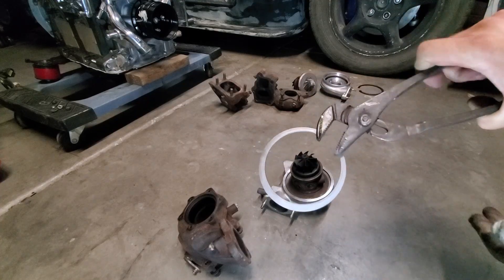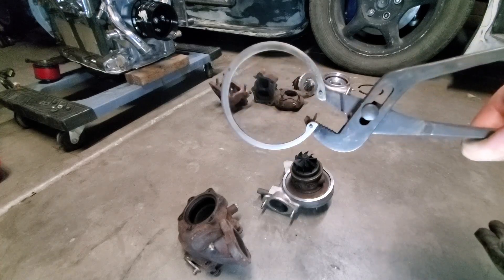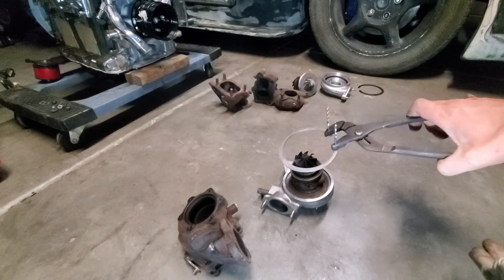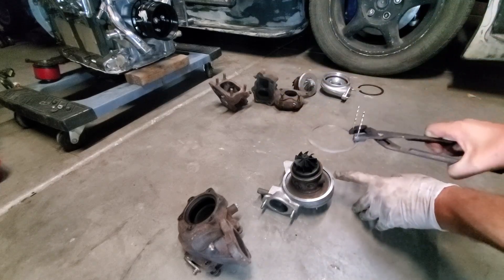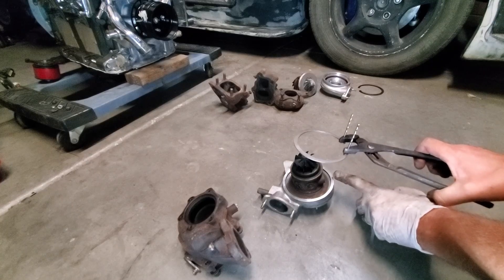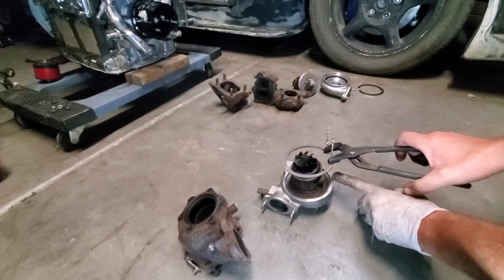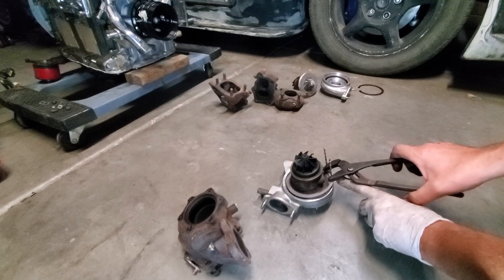This is the best way to go about it if your snap ring pliers are too small for a massive snap ring like this. We're going to go ahead and install this on the compressor housing. We've got our notch right here, so we're going to install it leaving our notch exposed, because that's where we originally punched the notch where it was exposed in between the mouth of this snap ring.